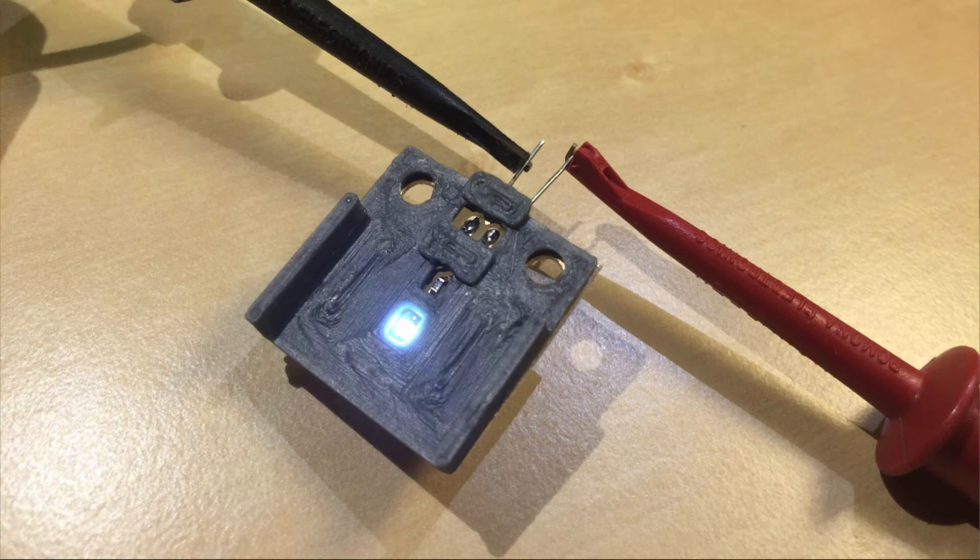This here shows the updated part assembled — I glued the PCB on top of the 3D printed part so that the LED protrudes from the small orifice. This design ensures that the location of the light emitter is very stable relative to the aperture of the tracking sensor, which ensures long-term stability of the adjustment.